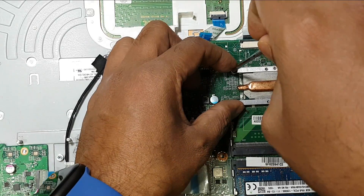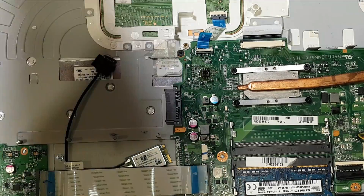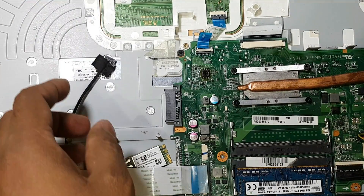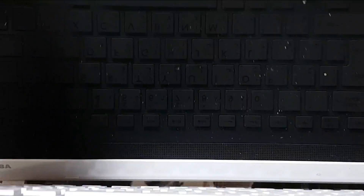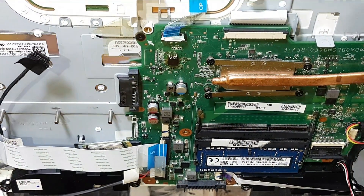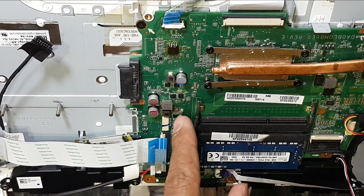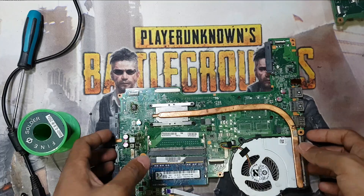Just connect the CPU. Now I will use the charger to check. Still have short? No - no short! And I hope it will work. Just place the power button and check. Now it's not working - it has power but won't boot. So I have to replace this IC.